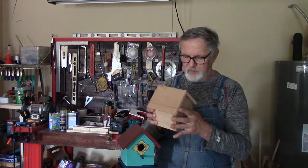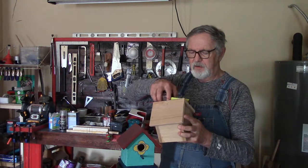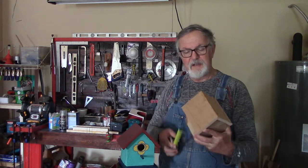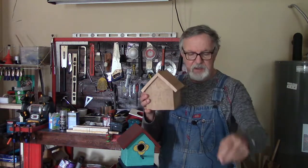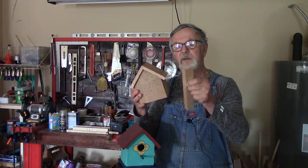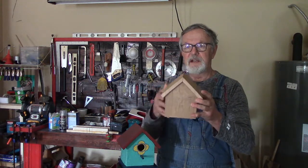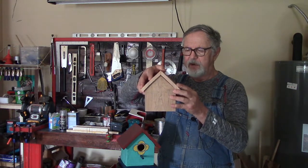Take another piece — this is going to be about six inches across, and each side is about five inches long. On the top here you run those pieces through a table saw and get a 45-degree angle so you're going to be able to make the roof. Now you take this lid and glue it down to the top of the birdhouse.